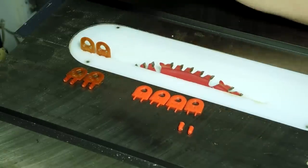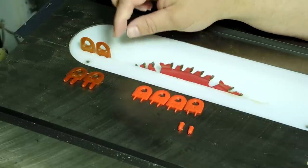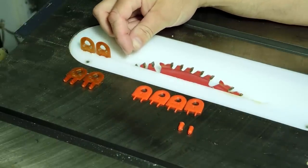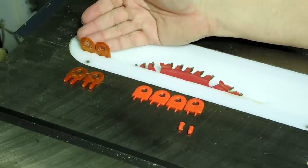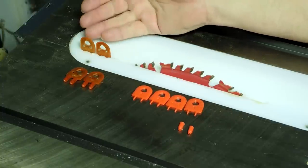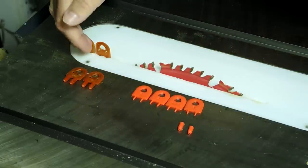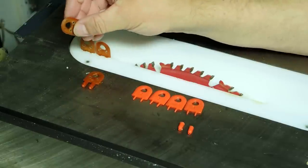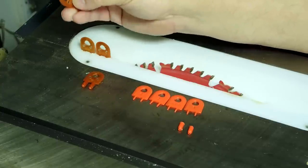The purpose of these splitters is to keep the kerf of the board open as it exits the back of the blade. You don't want the kerf to close up and the board pinching the back of the blade, which could cause saw marks, burning, or possibly kickback. Each side of the splitter is marked with a certain marking that tells how much it will push either your keeper piece toward the fence or your off-cut piece away from the blade. Get familiar with the marks on the sides and read the instructions to know when to use which type.